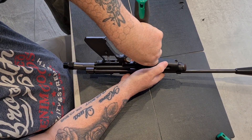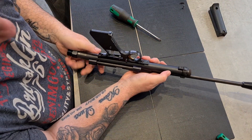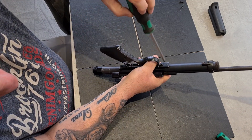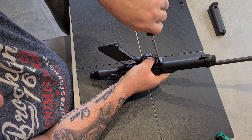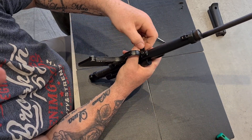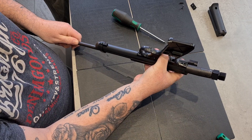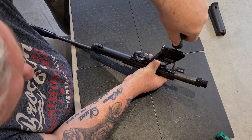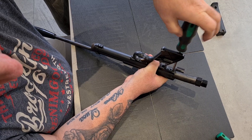As you know, the Crosman .22 range are pretty modular — once you strip one there's very little difference between them, which makes it a lot easier when you come to do other models. Not a lot of companies do that. So as you remember when you take the trigger frame off, you've got the ball bearing and the spring, so just be gently careful when you take this front screw up because you can scratch the front frame of the trigger. Turn it over, thumb in.